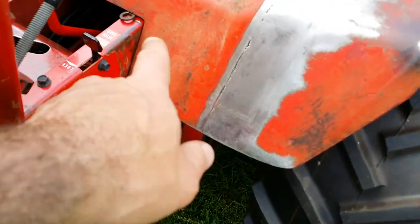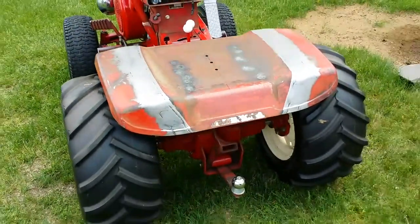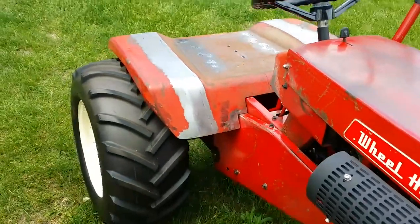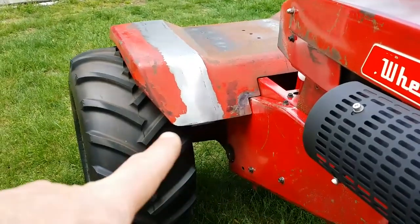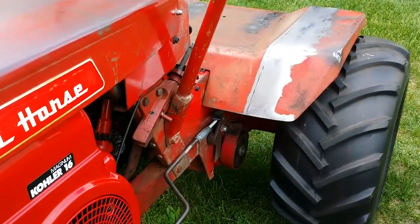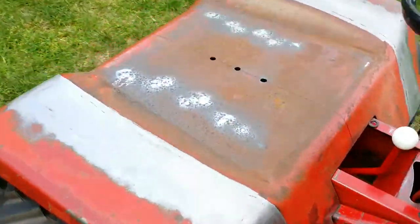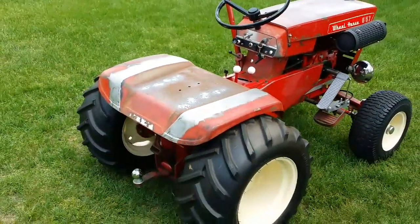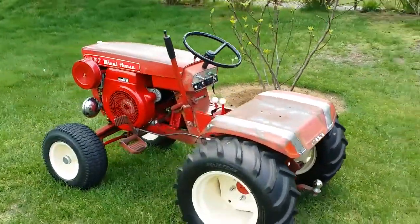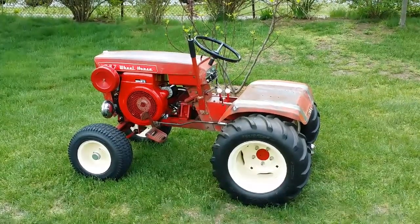Overall I'm real happy. I think the lower edges where I put those little patches in the corner look really good — they almost look identical. Unless you do exactly what I did, you're never really going to know. So the next step is to pull out the seat stay, which is spot welded inside the pan itself. I'll pull that out, start cleaning it up. I do have to do a little fix-it work to it, and we'll get that thing attached.